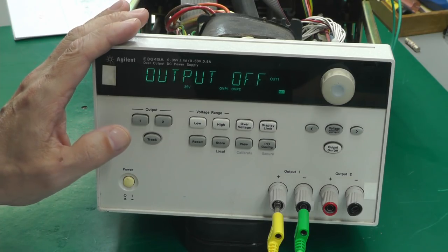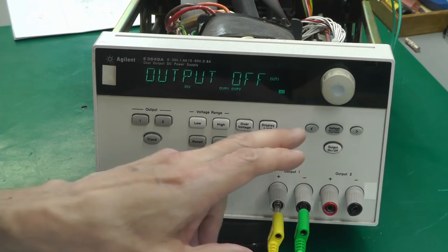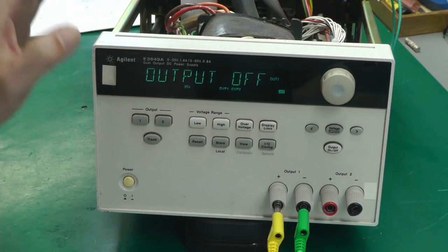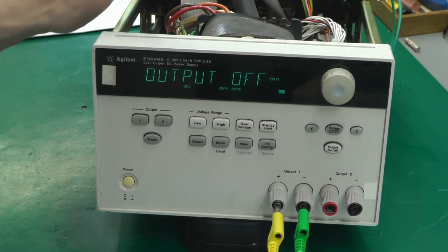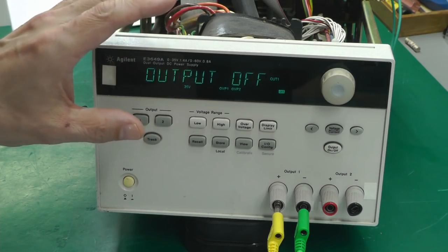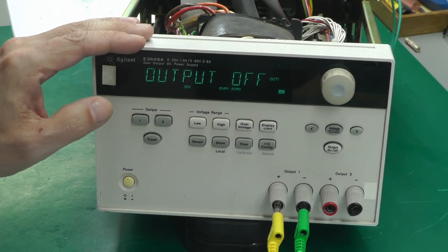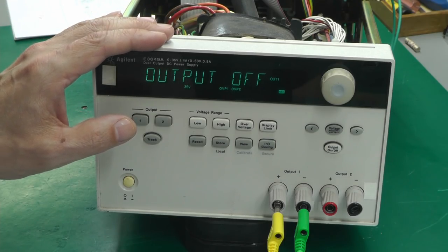The other thing it could be is a power supply issue, whereby playing with the front panel controls is spiking the power supply, something like that, and again it's crashing the main board. Or it could be the reset on the main CPU on the main digital board, or it could actually be the CPU that's inside the display board that's crashing, and that is in turn causing the main board to reset. I rather think that last option's probably the option I'm going to look at first.